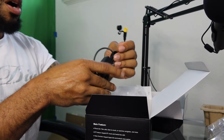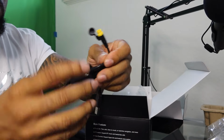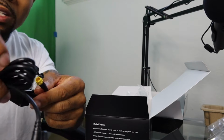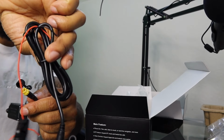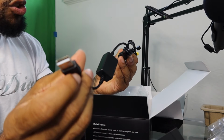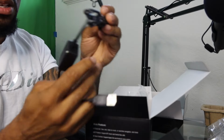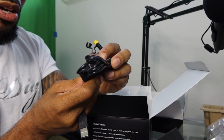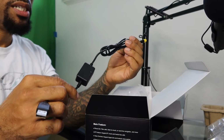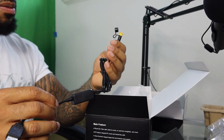So alright, and it looks like this is another way that you can connect it using a quick connect here, and you hook it into the monitor. This other quick connect actually had the red and black wire to hardwire it. And this has a USB, so I'm guessing this is not drawing a whole lot of amps. It looks like the input use for it would be 5 volt, 2.5 amps. So it shouldn't draw too much. It's 12 volt, of course, you need to have a 12 volt source for it.